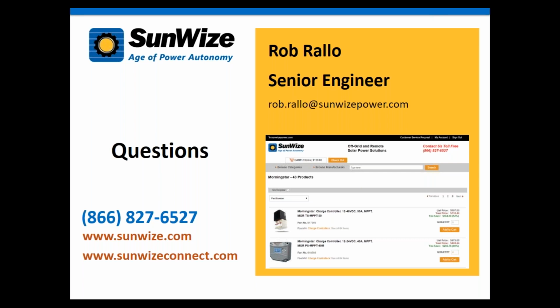You do need to know the other problem with a lot of these pole applications is that they have higher voltages too. A lot of them are 277 volts or 480 volts, which requires you to either put a small transformer in or use specialized power supplies or battery chargers for them as well. So that is a good consideration, as the higher operating voltages sometimes make it a little bit trickier. But yes, it's a good point to think about.